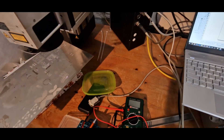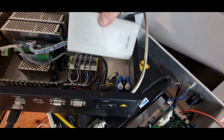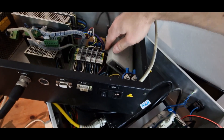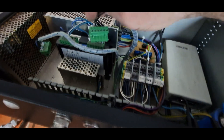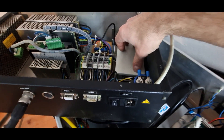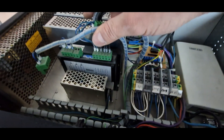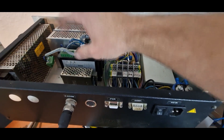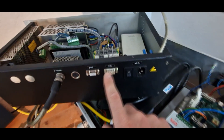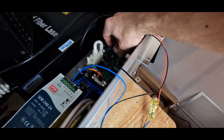Now I will continue to connect the motor driver. This is how the z-axis is controlled: right now we have this stepper driver controller which puts out the direction and step counts to the stepper driver itself. This is controlled by the PC software via UART connection — this is the basic stepper driver you know from many other projects.